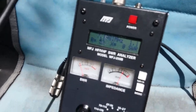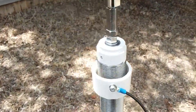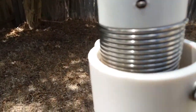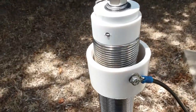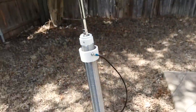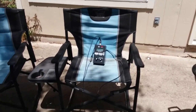It's able to get down to 1:1 SWR at about 7.2 megahertz and I'm not very far down on the coil. On the P80 coil I'd be almost halfway down, but on the Wolf River coil I'm not far down at all. I probably could have got the 40-meter one and still gone down to 80. I'm very pleased with this so far — I don't even have the matcher in line and I have a 1:1 SWR.